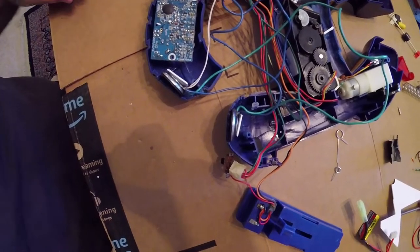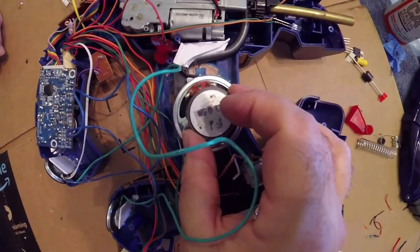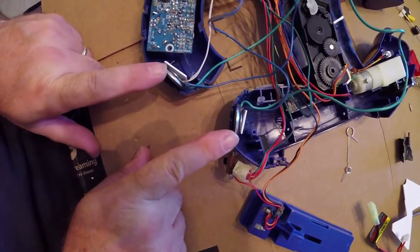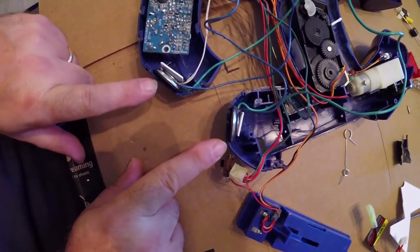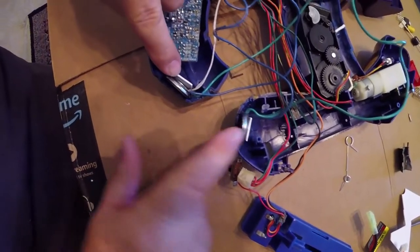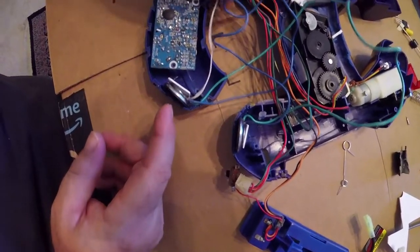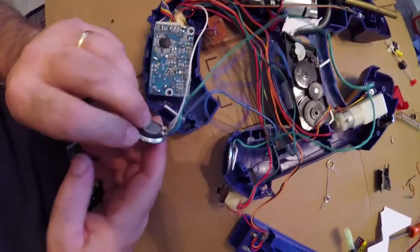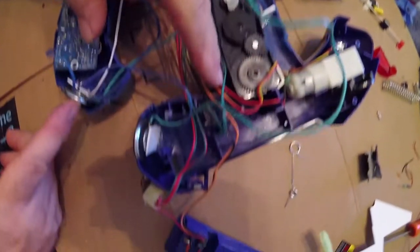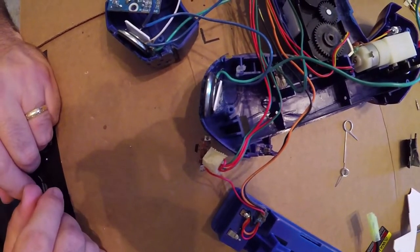We had one speaker located centrally, but we had to move it out of the way to make room for our BB feed mechanism. We've replaced it with two speakers — one in the back of the handle and one in the underbody — and we've put in white plastic flaps to keep them located so they won't rattle around. We ran the original speaker wiring to the first speaker and branched it off down the central column to the second speaker. We're hoping we get similar sound performance to the original.